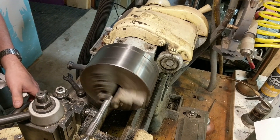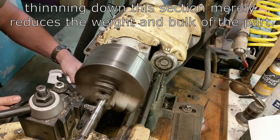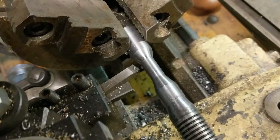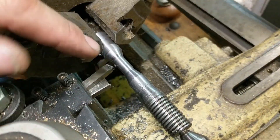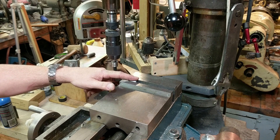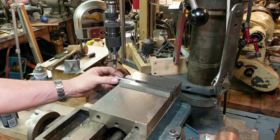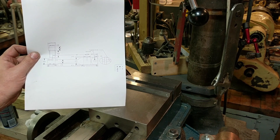I'm beginning to thin down the shank in between the two end lobes. Now we'll flip it around and clean up this other taper. There it is with the form turning finished — a quick beveled form tool I ground up out of high speed steel. Now we'll saw cut here and face that end off to final length. I have set this on parallels and clamped it in the vise so that it's parallel, and centered front and back using the centering function on the DRO. I'm now zero set on the very end of this piece, so I can just follow my drawing using this left end as the reference.